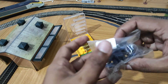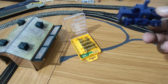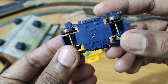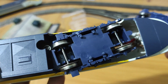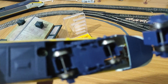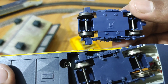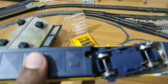Well, I got this — it's actually the front bogie from a power car, which I got from Peters Spares in the UK. If we look at it very closely, it does indeed have pickups. So what I'm going to do is replace the unpowered front bogie of this dummy locomotive with this powered front bogie. Then from there we're going to wire up the lights. You can see I've already done the lighting installation with wires, so it's just a matter of wiring things up and getting the polarity right so that when the unit is coming towards you the yellow lights come on.